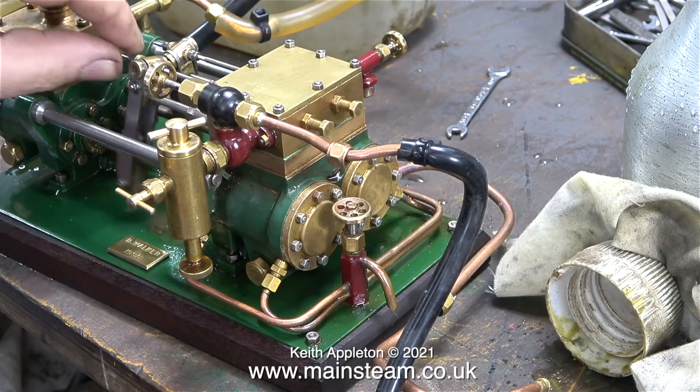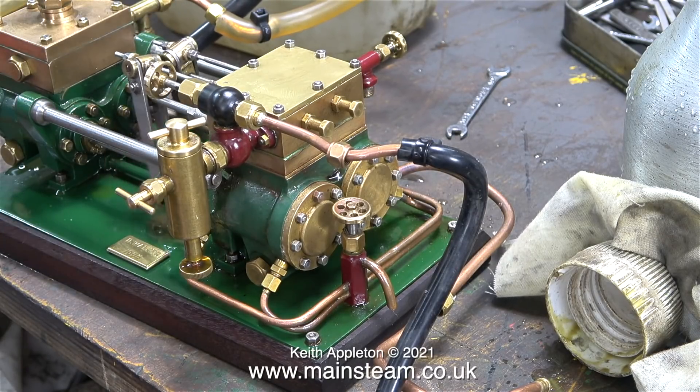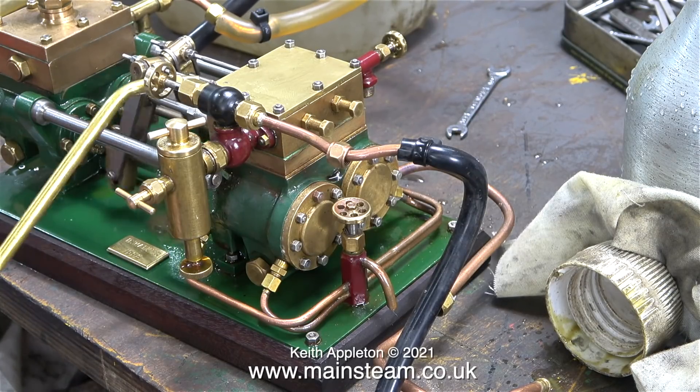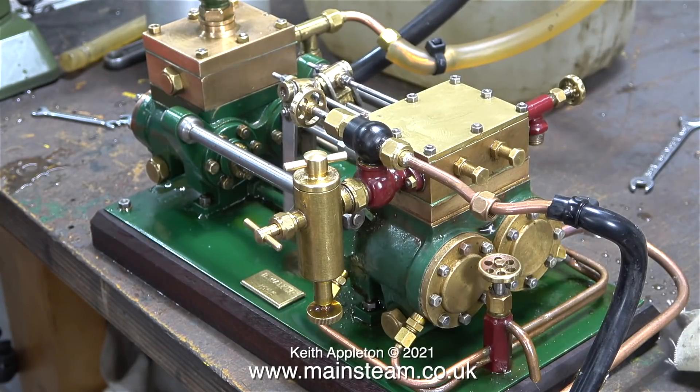This clearly shows that the sound of the engine is not 100% down to what's happening in the steam cylinders and valve chests. In the water chest there are eight valves, and for this pump to work perfectly all of those valves must not leak — though in reality one or two of them probably do.